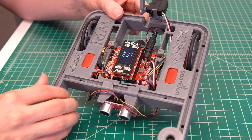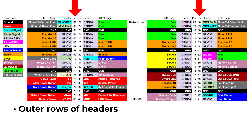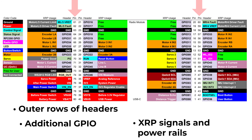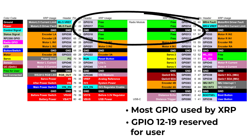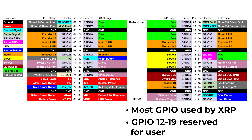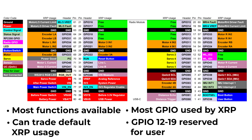The outer two rows of headers provide access to additional GPIO pins, XRP-specific power rails, and XRP-specific control signals. Be aware that most of the 48 GPIO pins have some default usage on the XRP, such as controlling the actuators or interfacing with sensors. However, eight of the GPIO — specifically 12 through 19 — have been reserved exclusively for the user with almost all functions available, meaning you can use them for any purpose you like. If you need more GPIO or different GPIO, you will have to trade their default XRP usage. For example, if you use one of the GPIO that interfaces with one of the motors, you will no longer be able to use the corresponding motor connector. Check which GPIO pins third-party Pico add-on boards use to see which features of the XRP you might have to trade.